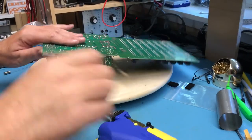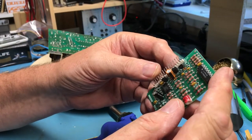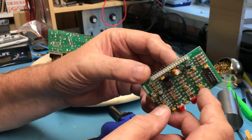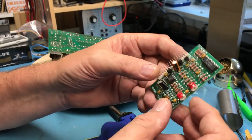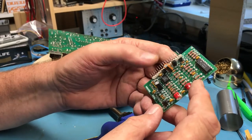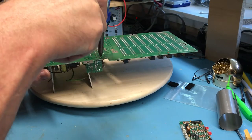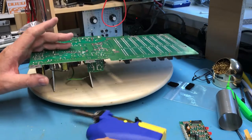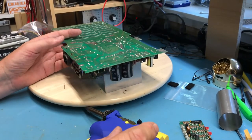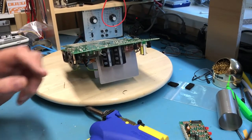This isn't going to be a repair video. That did actually unsolder — there's a little board here. It's got a TL494 on it and an MC342. I don't offhand know what either part is — they may be switching regulators. There are a couple of pretty cheap potentiometers there. I don't know that there's really anything on there worth salvaging. This other little card I may not be able to get out — it's got much larger pins on it. All these large storage components, transformers, and diode bridges are going to take a different tool to remove.